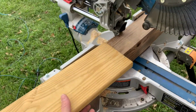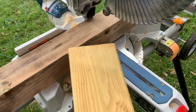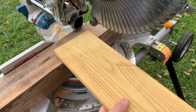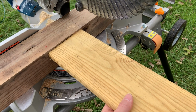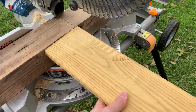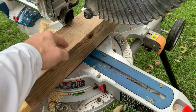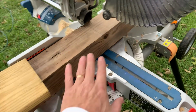However, we're also going to notch this out. This line here is my 9 feet, 1 inch. I'm gonna have a 2x6 header setting on it just like this. So what we'll have to do is once we get this cut, we will have to notch out a shelf on which the 2x6 header will set. I know I could just bolt it onto this, but by notching it out and putting it here, I'm gonna get another level of support on here than just simply bolting it in. So we're gonna notch this to fit the 2x6. Let's go ahead and make the cuts.